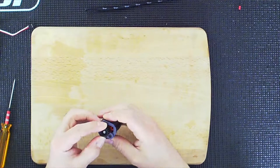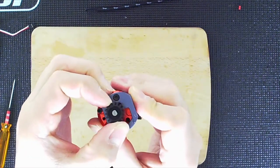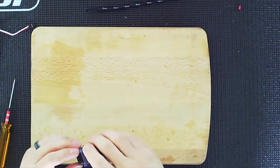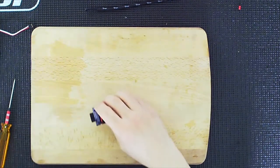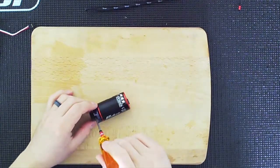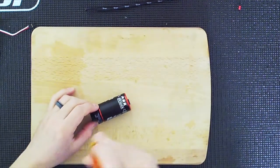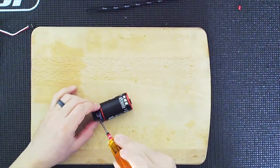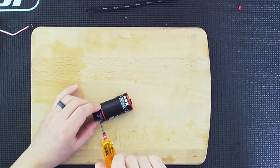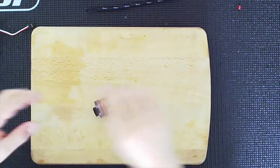Notice how I'm turning the shaft with the gear now — that's the reason I do that. I'm going to leave it like this and tighten it just a little with the two millimeter driver. The reason why is I still want to be able to slide it in and out.